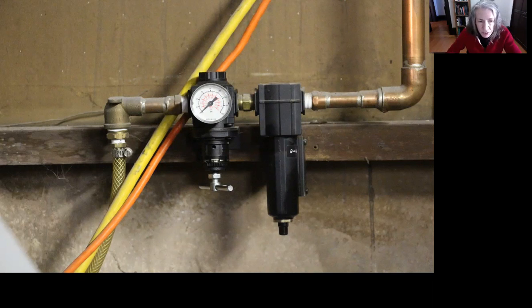In this image, you see two more things. The first is a pressure gauge, which allows your sandblaster to sandblast at different PSI. PSI means pounds per square inch. I personally sandblast between 80 and 100 PSI always, never lighter and never greater. Greater, you put stress on the system. Lighter, it takes forever. The thing on the right, this thing here, is a water trap. And mine does not work well, so there's that.